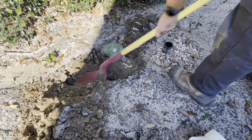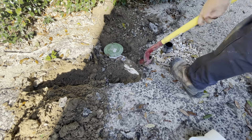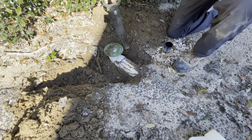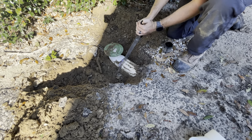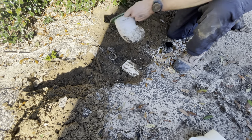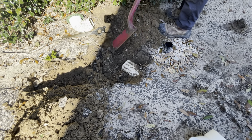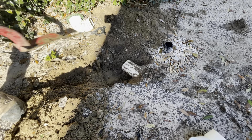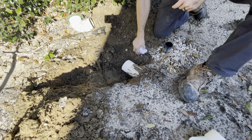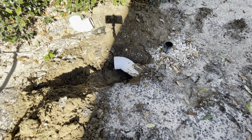This is the second gutter runoff. I'm just doing the same thing I did in the first one except I learned my mistake here. I'm going to uncover the pre-existing system first, then make my cut, clean the fitting, and we have to cut a 45 degree angle here to get down to where we want to be. I'll just put my angle on there first without glue or primer, that way I can test fit and see where I want it to end up. If you can learn anything from this video, it's uncover enough off that first system to gauge the trajectory of your new pipe.